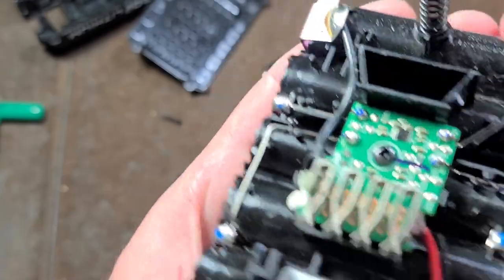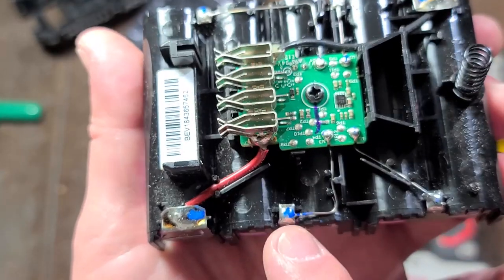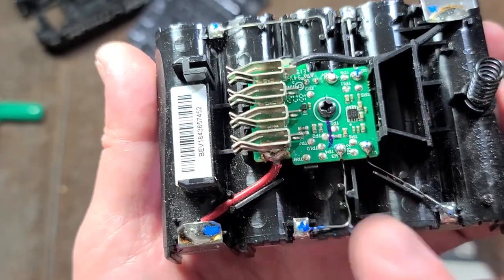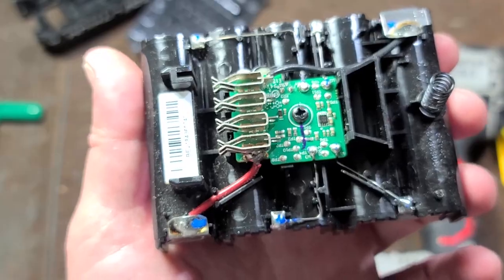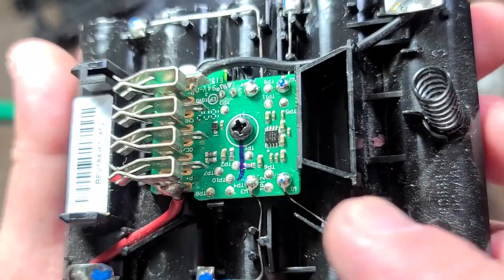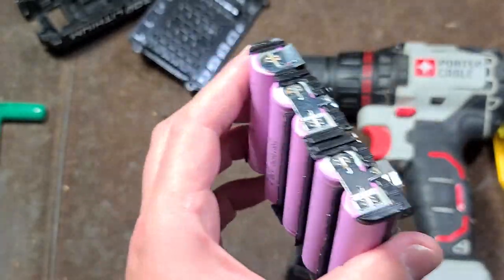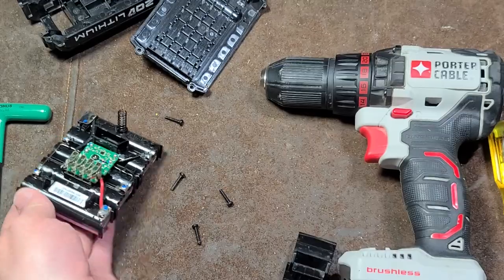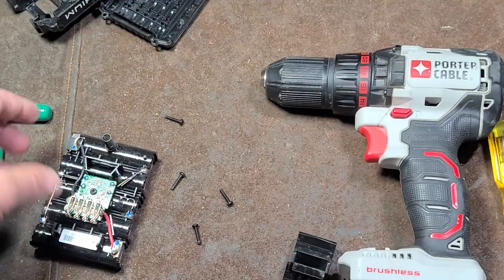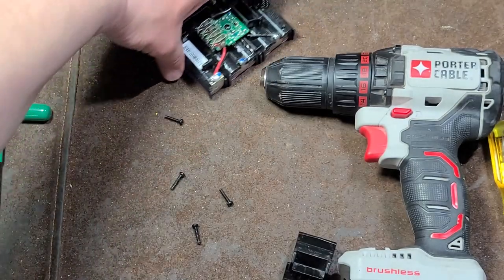There's a battery controller, and they actually are balanced — surprisingly — or better balanced, because we can see wires going into each of the cells. So the balancing is being done by the circuit board on the battery, as opposed to the balancing being done on the charger. We actually have a little bit of glue in there, and it even has a temperature sensor with a little chip and some other circuitry. Kind of surprised this battery is totally dead. It does have a date: 2018. So it's only four years old, but who knows with the lower quality stuff — maybe the charge controller itself is what failed.